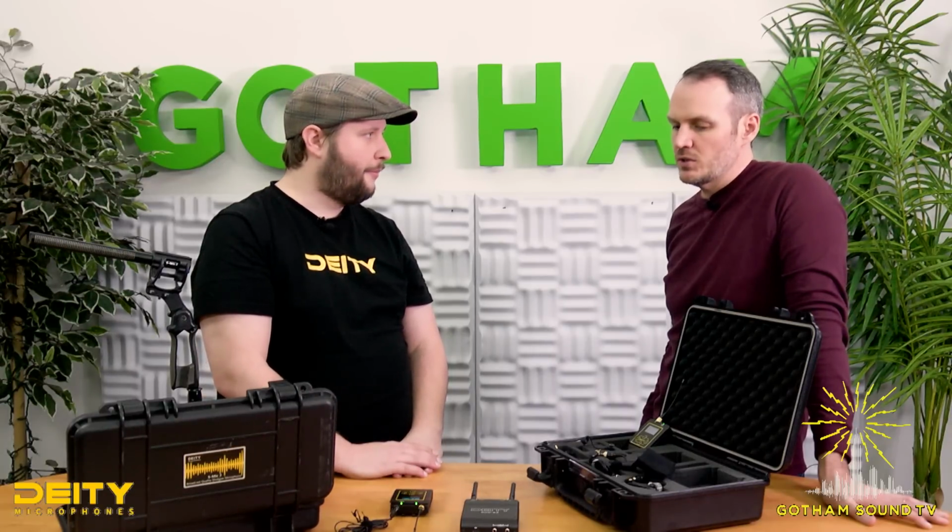Got it. And that means that you could use external 2.4 gigahertz antennas as well, like a CP beam or something. Absolutely, yeah. There's so many. In the option of 2.4 gigahertz, the directional antennas you have are even smaller than UHF because of scale. You can get stuff like Yagi antennas that aren't the size of this table. They're more like the size of my hand. And I can get really directional antennas if I really try to go for distance range and I need to punch through a couple of walls. So those are all available currently on the market. You just need to make sure you get the right kind of cable to go from the antenna to the actual device. Cool. And everything accessory-wise is already available.